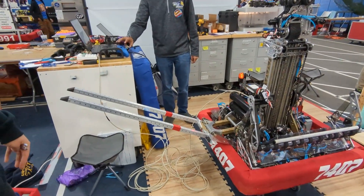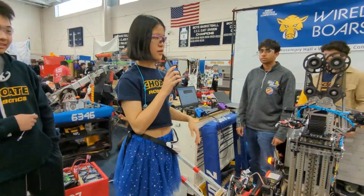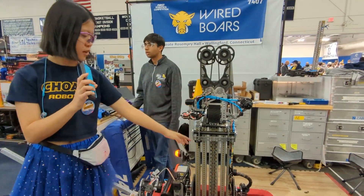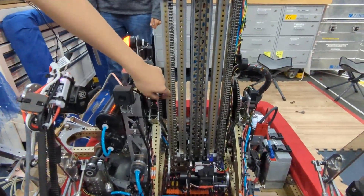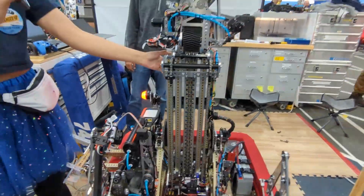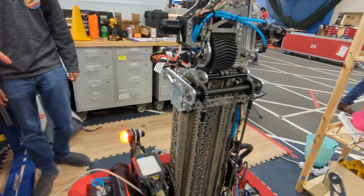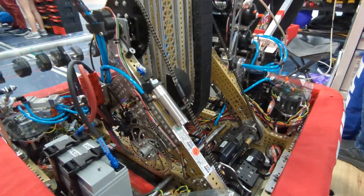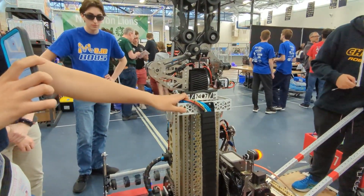That is a really cool design, especially with how it's been mounted. For our game piece manipulation, we have a three-degree-of-freedom arm. Our first degree of motion is a rotary motion — we have 3D prints bolted into a big plate sprocket, and when that rotates, it rotates our entire elevator along with it. A neat feature is that we actually have a bicycle disc brake. If you come around this way, we have a bicycle disc brake over here where a piston basically locks it in and we clamp down on ourselves, so that even when the robot is not enabled and the motors are not turning, there's practically no way for our arm to fall out of its original position. That's our first degree of freedom.